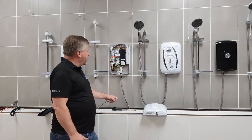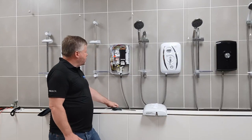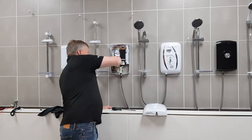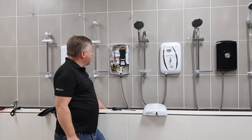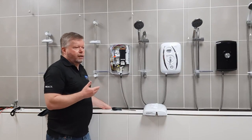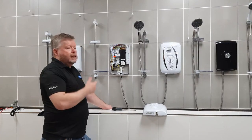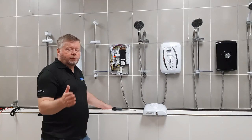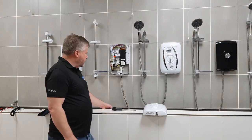Let's try it and see what actually happens. I've got my finger over the hose and it's trying to lift up, which means yes, we have got some pressure there. It still may not be enough to work the shower, but if you turn it to fully hot and don't demand any water, it's still lifting up — so we should be okay. It just means there's no pressure getting to the shower. That could be because your water pressure is pretty poor, or there might be an inline valve that is only partially open, or make sure your stopcock as it comes into the property is also fully open, so there are no blockages or restrictions in the flow.